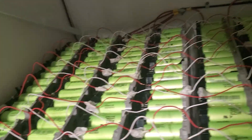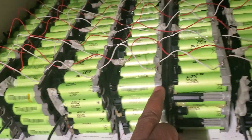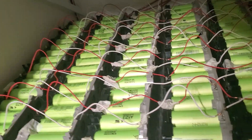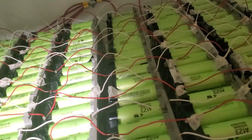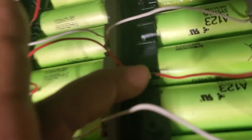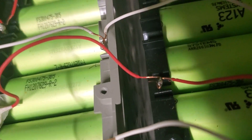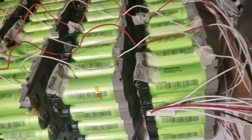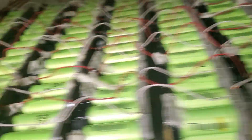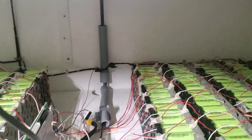Somewhere in here I was doing something, made a mistake, and — pop! I didn't have it on camera. I have this cell, this cell, this cell, all the way to the end connected. I changed the wire colors — I don't want to make a mistake. If you touch the wrong one, the wire will blow. There's a little fuse there — if you see that little thing, it will pop where you connected it. I've seen it happen before; I've done it before because I've had a lot of bad mistakes happen.